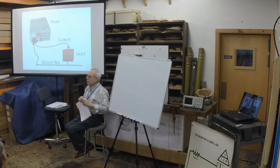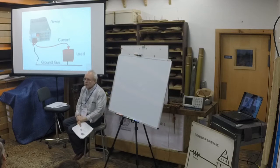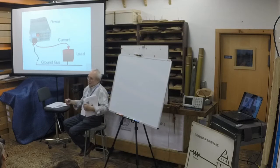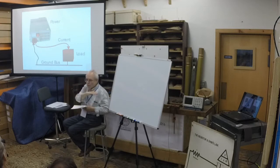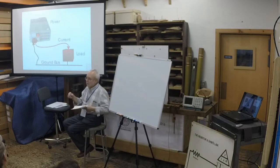I was asked a few years ago to go look at a Laterno organ actually, in Grand Rapids, Michigan, where someone had changed the power supply and the organ was behaving very, very poorly. So I'm driving there and just like little Jimmy, I'm thinking, ground wire, all the way to Grand Rapids. But no, in fact, they had multiple power supplies throughout the organ, and they had not put in a common ground wire between them. The only reason it worked was because of the third prong on the AC cord and the fact that they hadn't opened the Astron up and cut the black wire that connects negative to chassis.